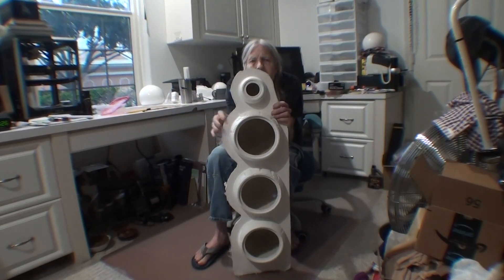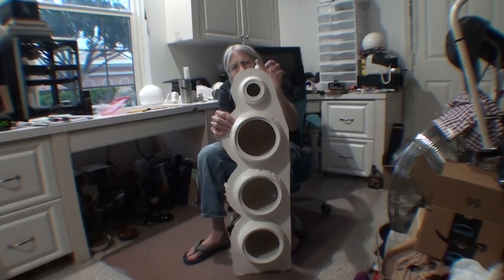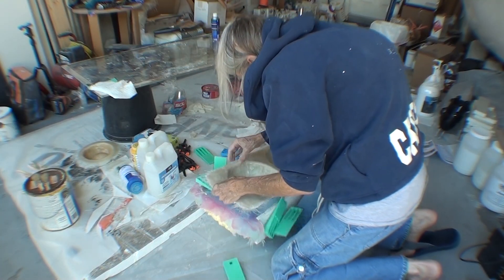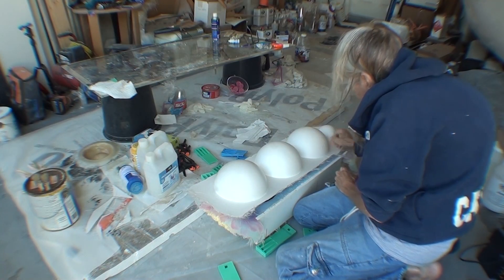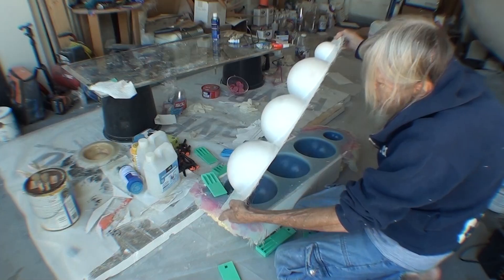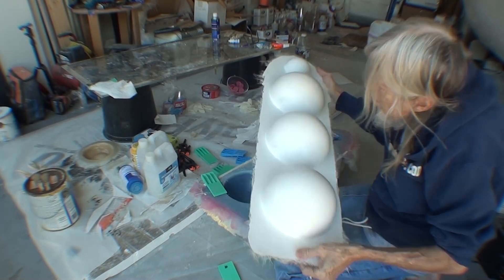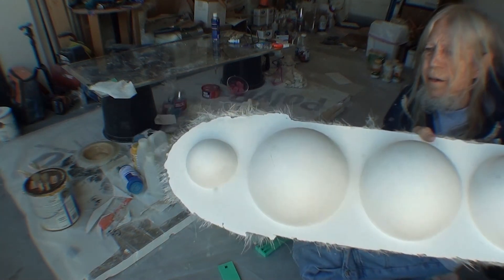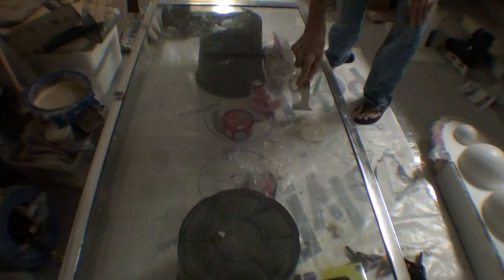This curved side — I don't know about that. It's harder to do and I really don't think it changes the aesthetic much. I think the straight almost looks better. Remember that part that I laid up at the beginning — that was all one sheet of gel coat. Basically, to prove to myself that I can make a good part without a bunch of drips and other stuff that was on the first part, the one that got made into that pathfinder prototype. Yeah, this looks great — the only thing on it is little extra fibers from the fiberglass.